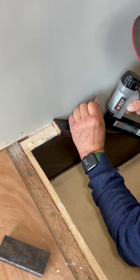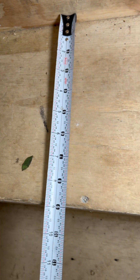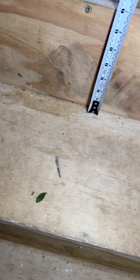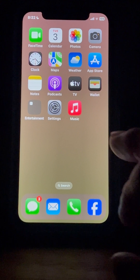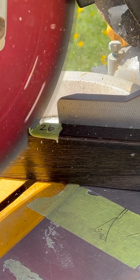Welcome back to my channel. I'm going to show you a really simple way to figure out the angles of your staircase to do trim called stringer cap and get it perfect. My run on the stairs — or my stair tread width without the nosing — is nine inches, and my rise is seven inches. I'll plug that into my calculator on my iPhone and come up with the right angle for the cuts.